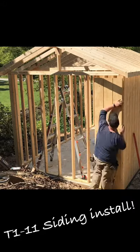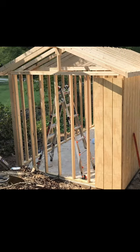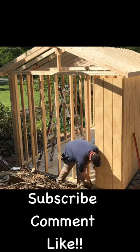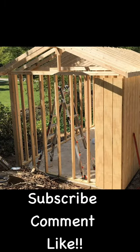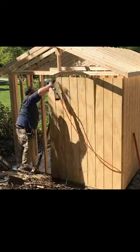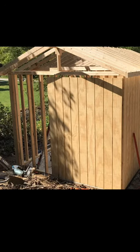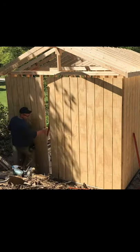Here I am putting T1-11 on by myself. I start off with a 10-foot wide structure, start off with a two-foot rip cut, and you square your building with your first cut. So you nail the right-hand bottom corner, pull the building left or right to square the building to the sheathing, then you just throw your sheets up.